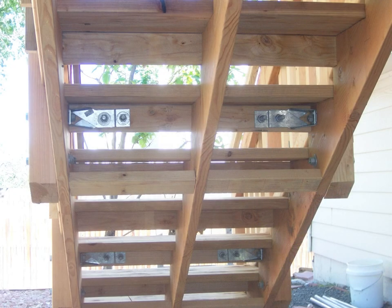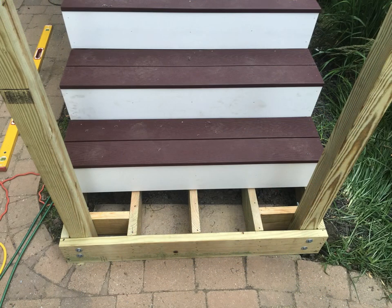Stairs are incredibly difficult when it comes to creating a stout guard post connection. In this example, they've used hold-downs for the top fastener tension and tied it with risers and blocking back to the center stringer — tying it into the structure of the stairs. The blocks at the bottom provide compression resistance for that bottom part of the post pushing in. The real concern is the lateral bracing of the whole stair — will it just sway back and forth when the guards are loaded? The bottom of stairs is also tricky because the limited riser height limits how far apart the fasteners can be, and often you'll find guards at the bottom sunk into concrete foundations to help support those loads — kind of like a fence.